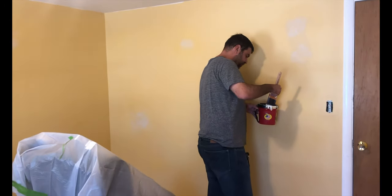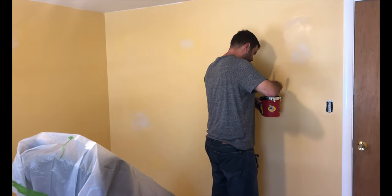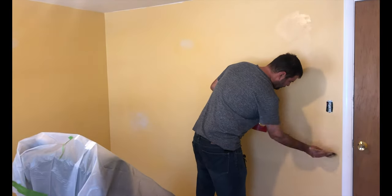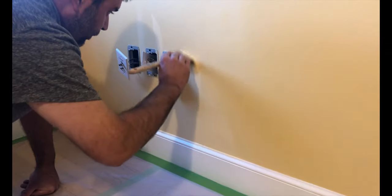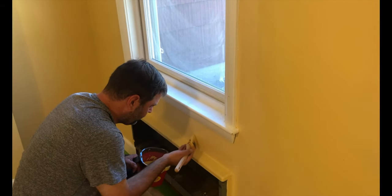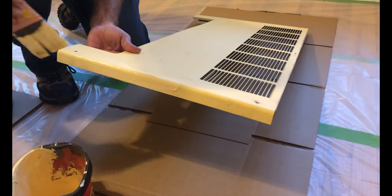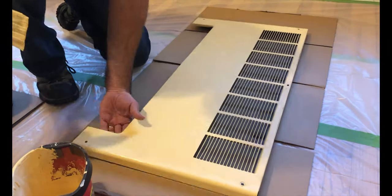I then lightly brushed over the areas where there had been fresh mud applied. I do this because the mud absorbs the first coat of paint quite a bit, and if I didn't brush on a little bit first, it would require me to do a second coat of rolling because the first coat would come out looking pretty splotchy. Once I finished the first go around, I went back and did above the baseboard, continuing to also hit around the outlets and give myself a nice amount of girth so that when I come back with the roller, I don't risk rolling over my outlets. I took this opportunity while I had a brush out to also put a coat of paint on the radiator cover as well.